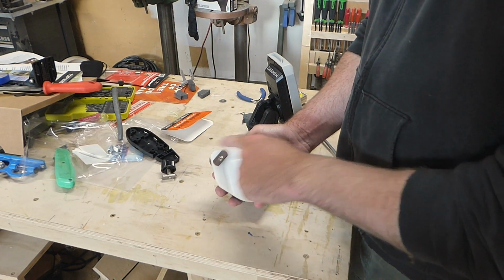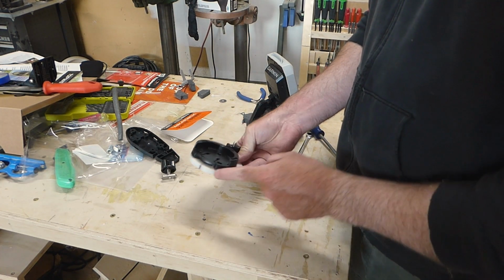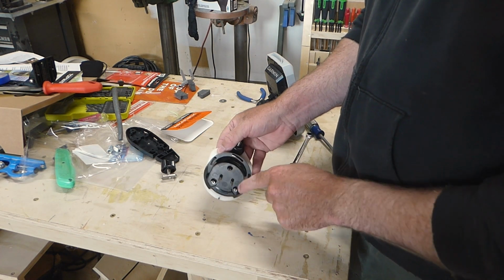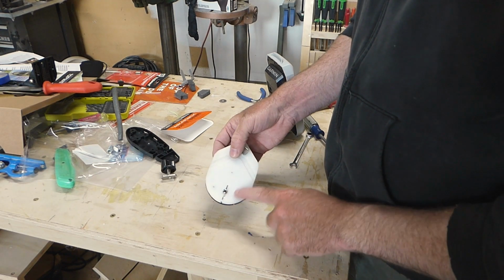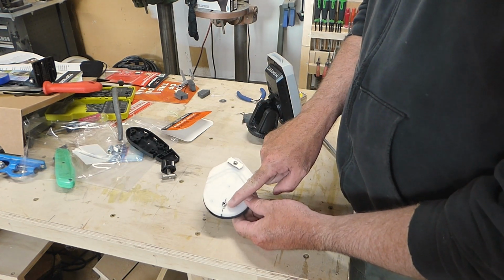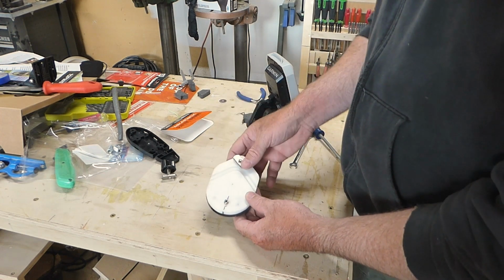This was the corner of the cutting board, and then I used the circumference of this to lay out that, cut it out with my jigsaw, mounted this, just drilled holes and screwed these directly in. They tapped themselves, and then I just filed off the little points that protruded through. I put this little screw head here, and what it does is it fits in the slot of the track.